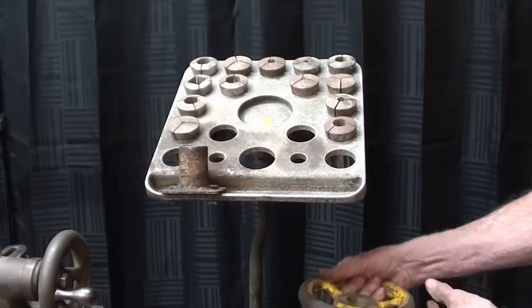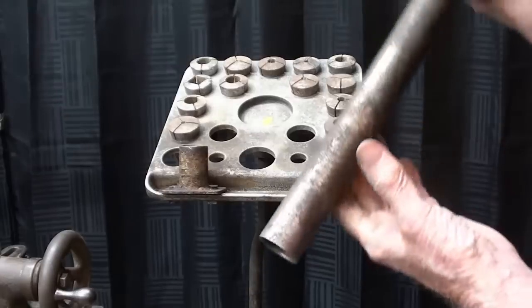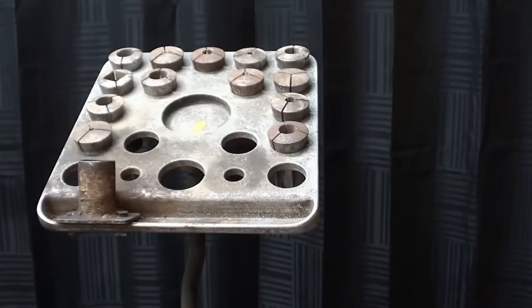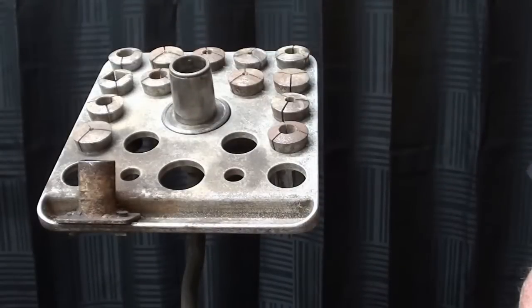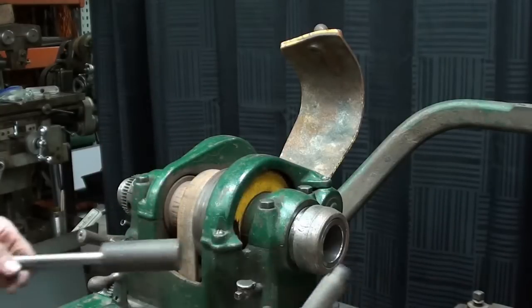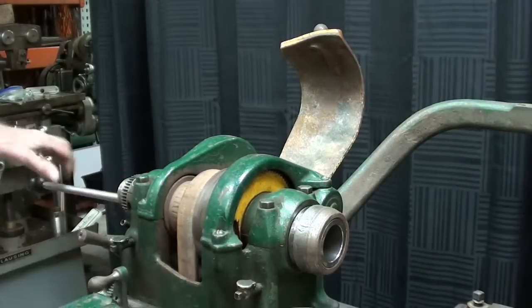We're a little short. There's another possibility here with the drawbar — putting it in through this larger hole for storage. But I want to make a big point right now: with drawbars, if you drop these, it's a relatively thin wall. If it fell out of the rack and hit the concrete floor and bent a little bit, you might as well throw this thing away. For 75 years I was wondering what this recess is, and I just found out — it's for the adapter, I presume. In order to knock the center out of the spindle, we use a ramrod. Now this one is too small — it's meant for a nine-inch lathe. But I had this one downstairs — in fact I had two of them. I made this one a few years ago; it's brass, a big piece of brass. It can be used for knocking the center out. It's got a lot of weight to it as well.